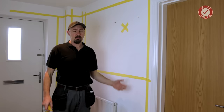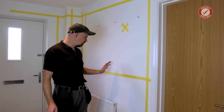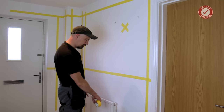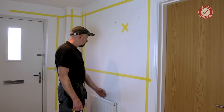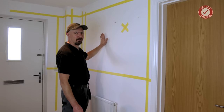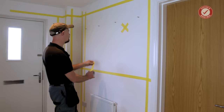For water and gas pipes, as far as I'm aware there aren't rules as strict as the electricity regs for where they can run — correct me in the comments if you know otherwise. We'll just rule out the obvious: here's a radiator, so there must be pipes running to it somehow. It's a concrete floor so the pipes almost certainly aren't under the floor — they're probably running up this wall. If the radiator's on, you can normally feel the warmth in the wall from the central heating pipe. So do not drill where you feel warm bits of wall — this entire area up here is potentially a dangerous place to drill.